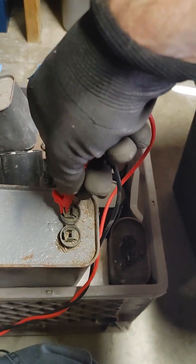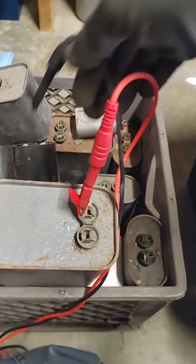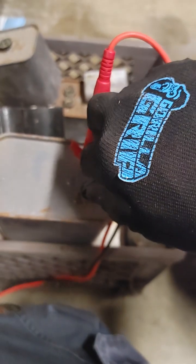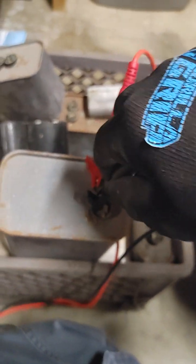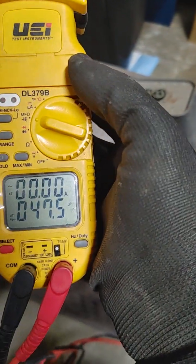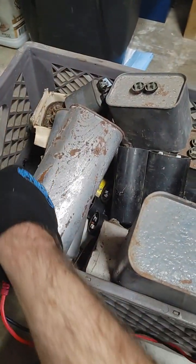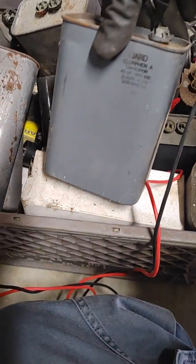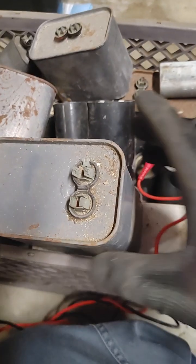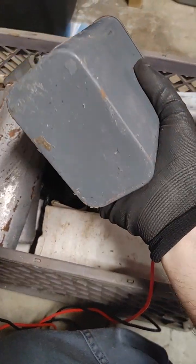I know this is probably one of the best run capacitor videos on YouTube, I would say. Alright, you can bite down on that. And it says 47.5, and it was a 45, right? Yeah, so that's good. It's within spec. Actually, a little above its rating. That's good. Look, this is still good.